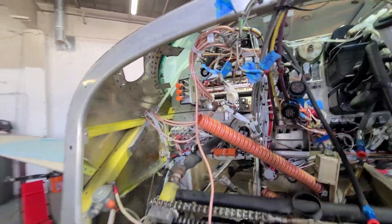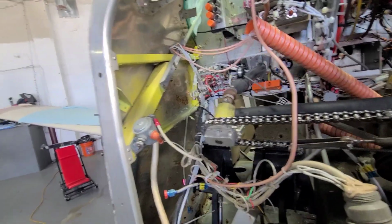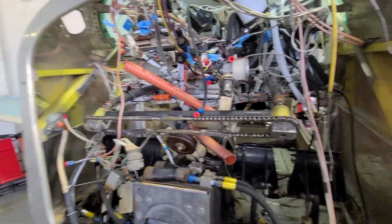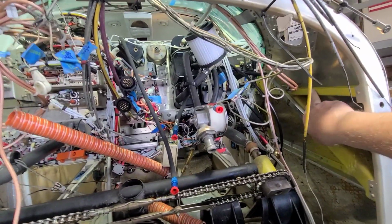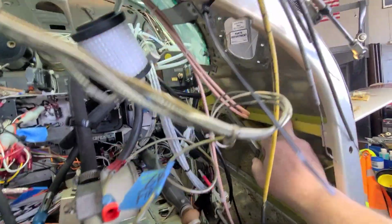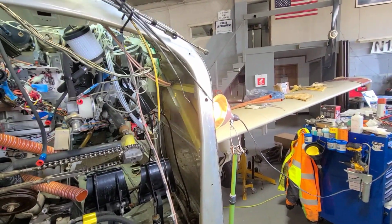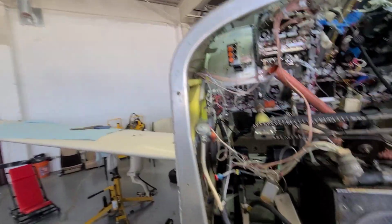So as these things get older, they like to corrode, and our mission now, besides maintaining these things, is all this corrosion prevention we have to do to them. And I believe 100% that this was corroded. These pieces were corroded, which already had weakened it. So when that thing shimmied, the already weakened beams there just broke and pulled the rivets through on the sides. So keep an eye on it.